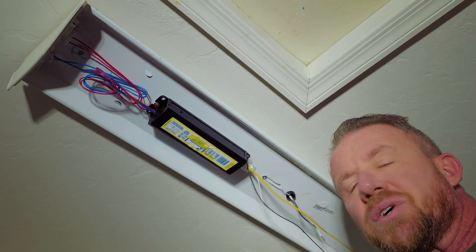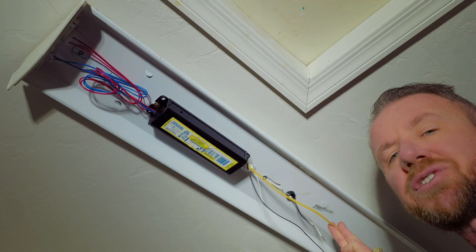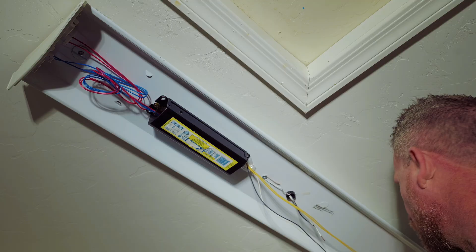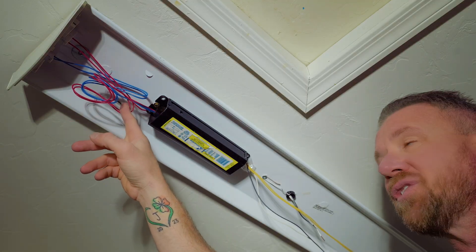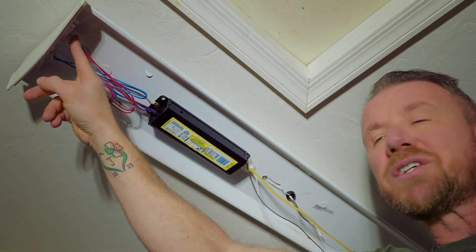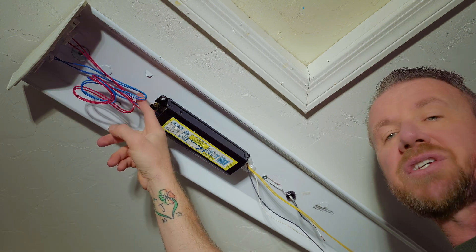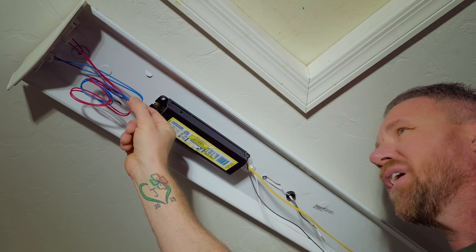There are a few ways to do this. I'm going to show you the easy way, which is to snip your existing wire and strip it and use new wire nuts just to tie in your new ballast into your old existing wiring. If you don't want to use wire caps and just use your full-length wiring on your new ballast, you could do that too, but you'd have to remove the wires from the light sockets and reinsert those. For me, it's easier just to snip these and then tie in the new wires from your new ballast into your old existing wires that head to the light sockets.